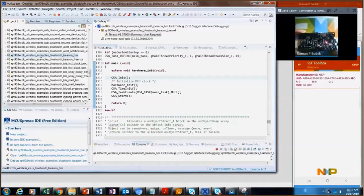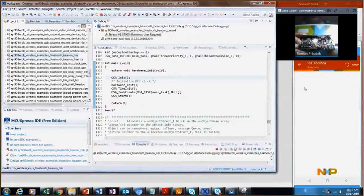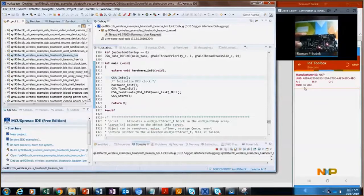And it's transmitting. The video here is running a lot of stuff live, so it's a little hard to see the update, but this is giving a live update. I only have one sensor board, so that's all that's showing up here. If I cover the antenna with my finger, that would simulate moving further away from the object. I do see that a live update goes. Now there's a lot of stuff going on here, so it doesn't necessarily show up as quickly. But if I cover it with my finger, I see that the dBm gets higher, similar to being further away from the device.